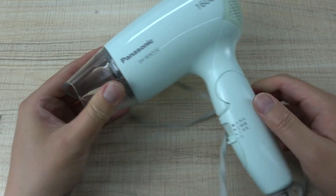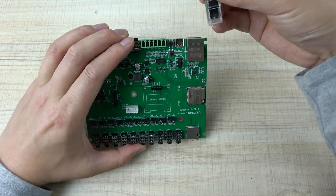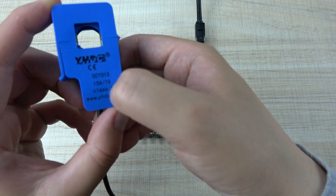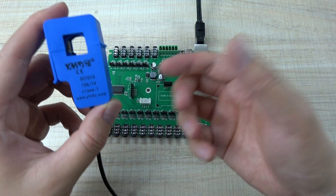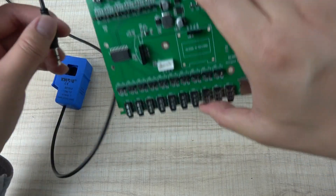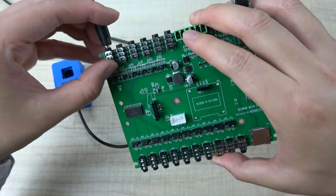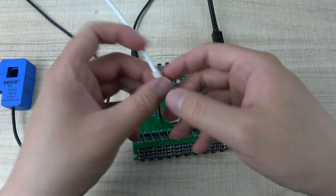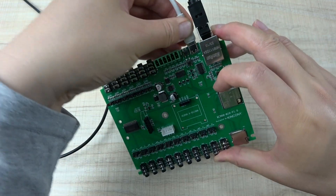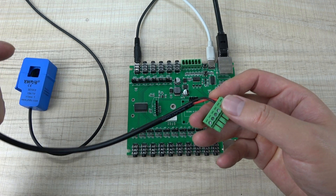Now I will show you how it works with Home Assistant. I'll use this lamp for a test. You can see I've connected with an Ethernet cable, and I've chosen the 15A current CT sensor. If your line carries a large current, you can choose another one — maybe 100A. I have connected the CT clamp to channel 1. This USB cable is used to download firmware and monitor state. The power line is connected to 12V DC; you can also use 24V DC.